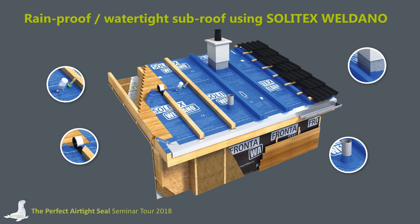Sometimes it's very important to have membranes that can be used down to this roof pitch, because the Solitex Plus membrane is only suitable for roof pitches down to 12 degrees. This is defined by the BBA approval, which states that a diffusion-open material based on polypropylene spun bond should not be installed below 12 degrees.